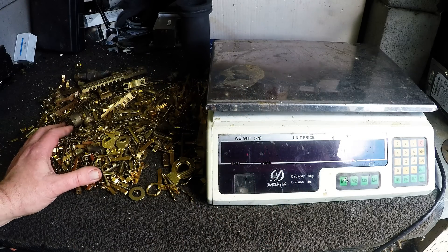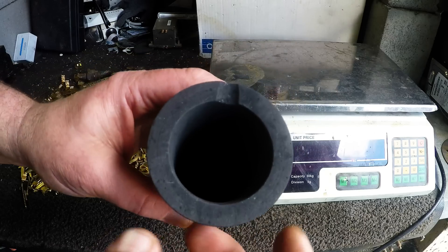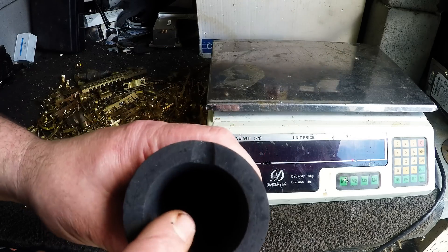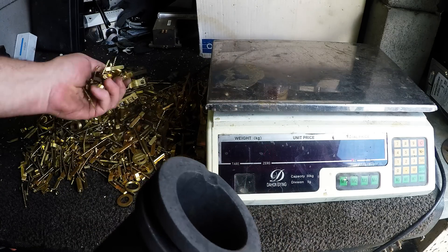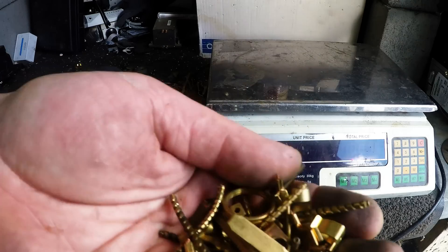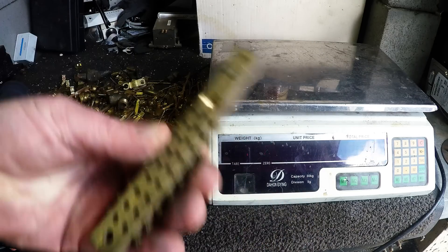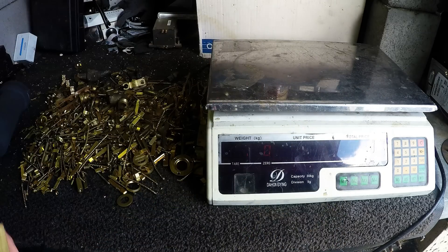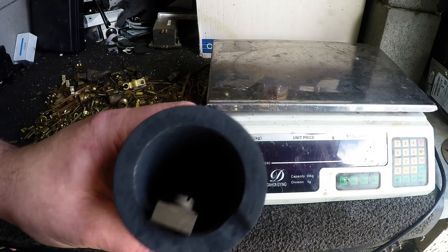What I want to do is try and make 1kg bars, as close to it as possible. I've got my 3kg crucible here. Whilst it will fit 1kg of brass no problem once it's melted, it's not going to fit 1kg before I melt it. So what I've got to do is stuff it as much as I can at the start with the small stuff and the lightweight stuff. Once that melts down, I can put some heavier items in — I might be able to drop in some of these larger pieces. I've got this nice little oddball bar that weighs over 200g on its own, so once the first part starts to melt down I can drop that in and keep it going.